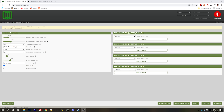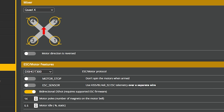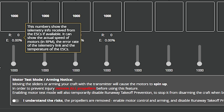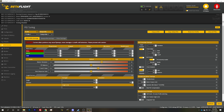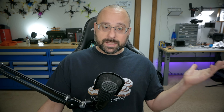Then I'm going to hit Flash and it's going to flash all of those ESCs. After flashing, the number one thing you've got is not an option — it's just there — and that is access to bidirectional D-shot. Here in Betaflight we can go to the Motors tab in Betaflight Configurator 10.8, the newest version, where they've moved the D-shot settings. We can enable bidirectional D-shot, save and reboot. In the Motors tab we can see 0% errors, which with stock BL-Heli S we would see 100% errors. We can now use RPM filtering — in the PID tuning tab under filter settings, the gyro RPM filter is enabled.